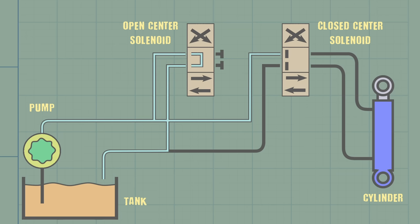And the way I do that is with the microcontroller and this delightful rat's nest over here. I've got these big MOSFETs, they're basically transistors, and I'm using them as switches, switching them off and on very quickly, like thousands of times per second. And that basically turns them into dimmer switches. Then I measure the current across a shunt, which is this big resistor, and I feed that back to the microcontroller. And the microcontroller essentially decides where to turn that dimmer switch to keep the current where we want it. And that's called pulse width modulation. Specifically, it's closed loop pulse width modulation.